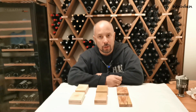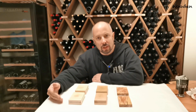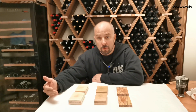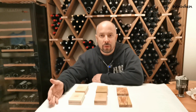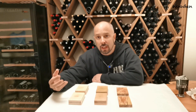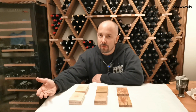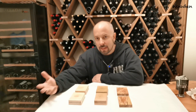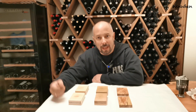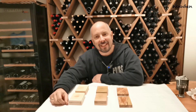I think I've concluded my experiments. My conclusion is that the accelerator helps to protect especially soft woods. So if you're treating a piece of soft wood with Rubio Monocoat, I would recommend you use the accelerator. If you use harder woods such as oak, olive, tropical woods, or other hardwoods, it's not necessary to use the accelerator — I don't see any advantage beyond the speed advantage if you need that. You can go without it and save the money, just use the time. All right, that was it. Thanks a lot for watching. I hope you liked this little experiment. If you did, don't forget to give me the thumbs up, subscribe to my channel, and see you around.